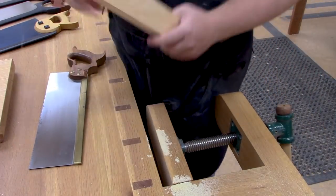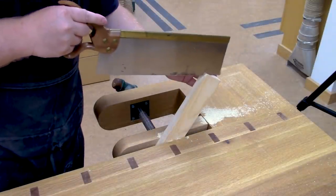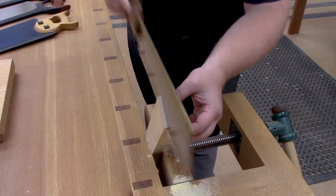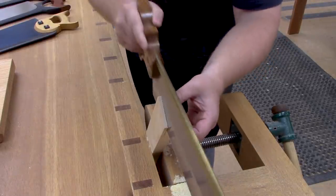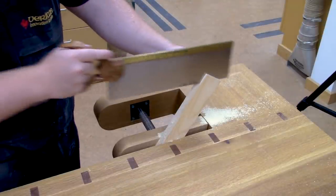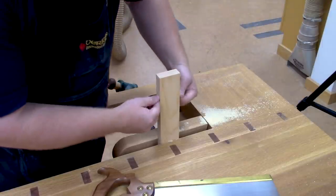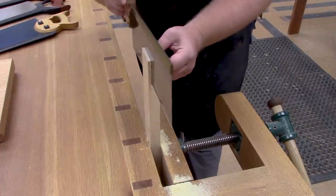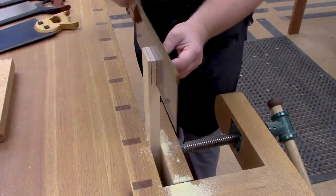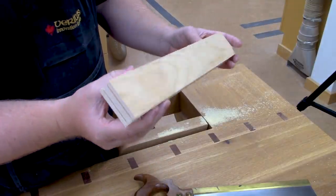We got right down on the line. This side has been cut, this side has not, so I'm going to turn this workpiece around and angle it again. For that second cut I'm angling it as well, just using my natural cutting position. When it gets down to the very bottom I don't want to go past my knife lines for my depth. Now I'll stand this up and double check both sides — and we have the basic shape of the tenon sawed out.